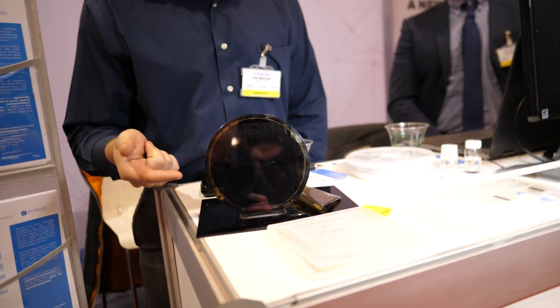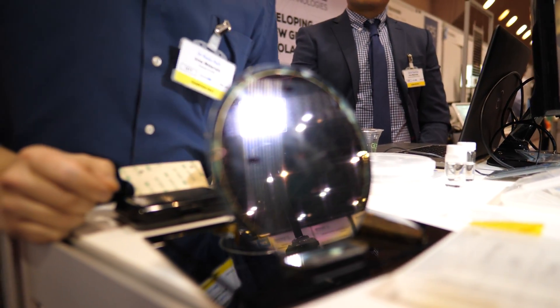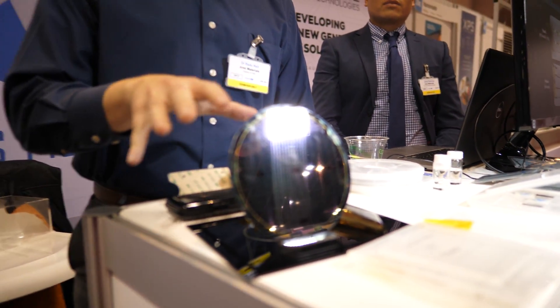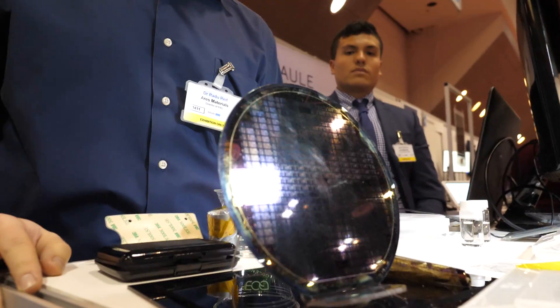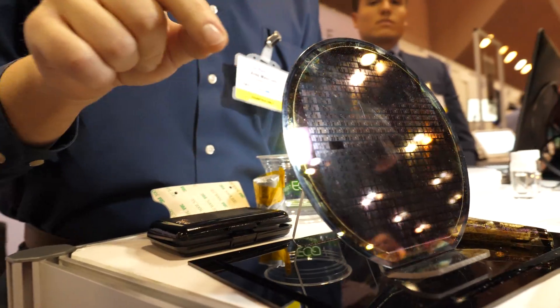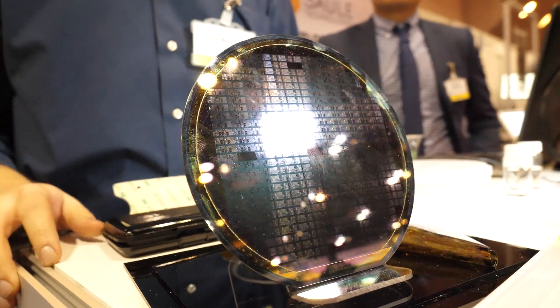So what are we looking at here? We have a lot of different materials. What you're looking at here is one of our flagship products, PILUX MF, which was used as a substrate for thin film transistor microfabrication. Here you have a model array of metal oxide IGZO thin film transistors that were fabricated on PILUX using a silicon wafer as a carrier for the microfabrication, which is the state of the art currently in the industry.